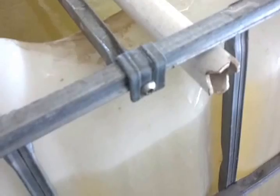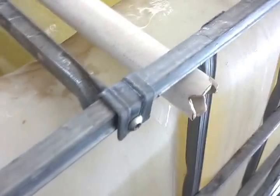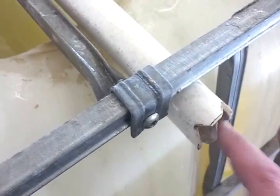I'll try to go as quick as I can here so this video doesn't stretch out forever. Just like any other solids lifting overflow that you'll see, you cut notches in the bottom of your pipe, so when it sits all the way down on the bottom of your tank, water has a way to get in. These little notches cut in here — I just did that with a bench grinder and chopped them in there.